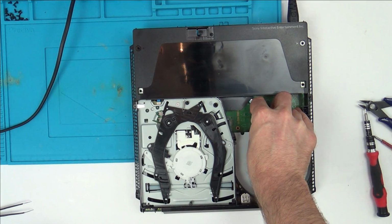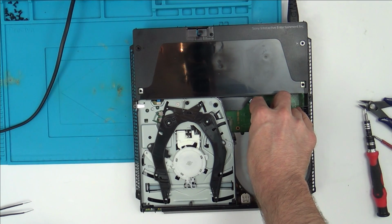Right, so it's got the blue light at the moment. You can't even see the blue light, can you? Right, so it's pulsing. But the fan hasn't actually kicked in. I have got the fan plugged in, so I would have thought surely the fan should be spinning. So that says to me there's an issue there, isn't there? Because the fan only spun for about a split second, then stopped.